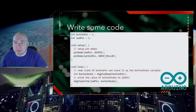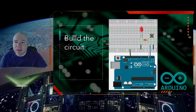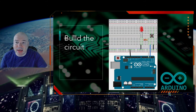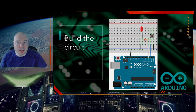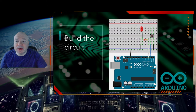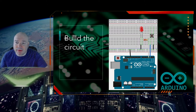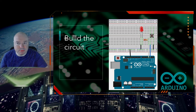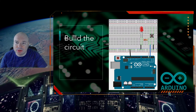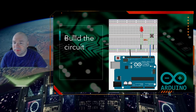So button pin 2. Then LED pin is going to be on pin 3. So let me show you the board again. Here's the LED pin, and I'm going to connect it to pin 3, but I'm going to connect it by way of a resistor. Remember, we talked about using resistors. This is a 330 ohm resistor, so we don't burn out the LED, because this 5 volts going to this resistor could burn out the LED. So we have this resistor in the way. Remember, in this case, it's going to reduce the current and reduce the voltage enough that it does not blow out our little LED there.